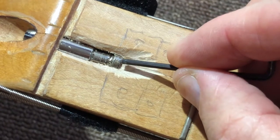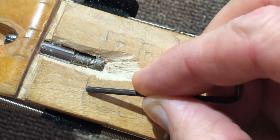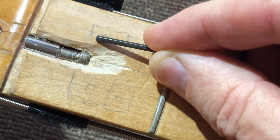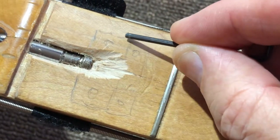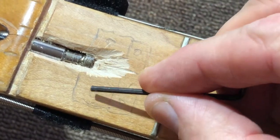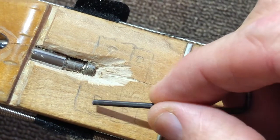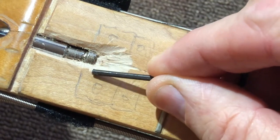And then I'm going to put a small sheet of brass there, about that size, pressing up against that. So I have to route her down further for the brass sheet to go beneath the layer of maple, because the maple layer is going to be hiding the brass sheet. So that layer of brass sheet there will have, just like I suggested, four screws embedded into the wood as solid as it could.